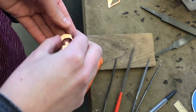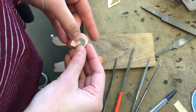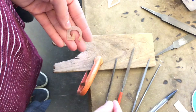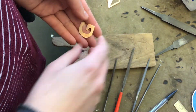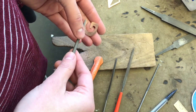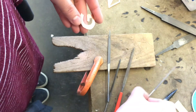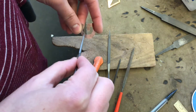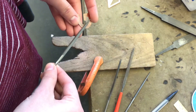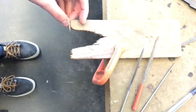For my piece, which is pretty rough, I have an exterior curve and a little interior curve. If I'm doing the interior curve, I want to use a rounded file that matches the shape. This is a half round file — this side is round with a pretty gentle curve. I could also use a fully round one, but it's a little more rounded than what I want. I want to match this curve, so I'll use the half round.